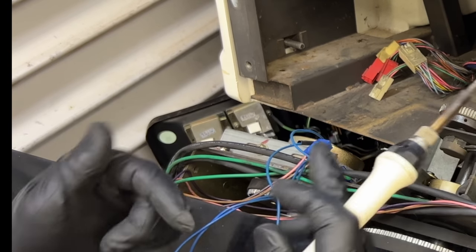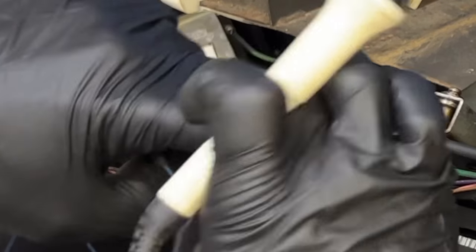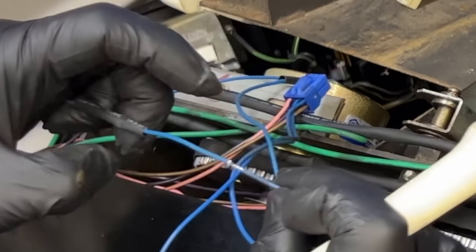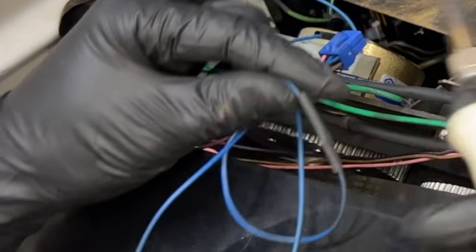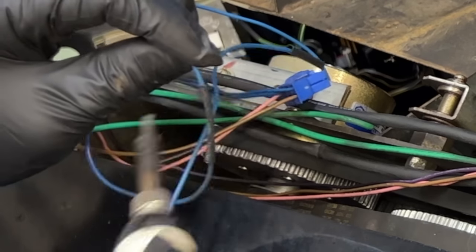Apparently some people don't like the way I connect wires together like this when I'm soldering. The reason I do that is because when I wrap them around, which is what I used to do, it's too common to get a little spike pointing out, which can pierce the heat shrink, so I just stopped doing it that way and started doing it this way. I mean, it's still plenty strong. And if the wire's getting hot enough to melt it, I think there's other problems.